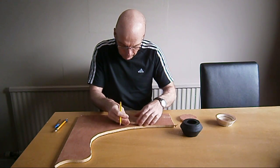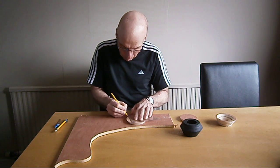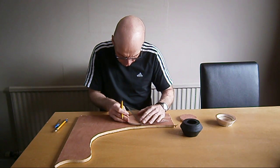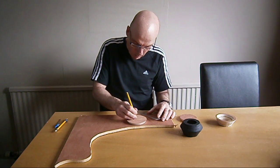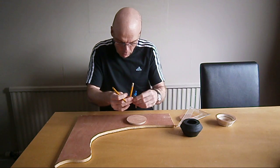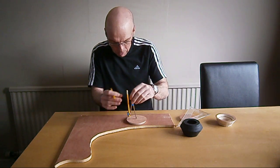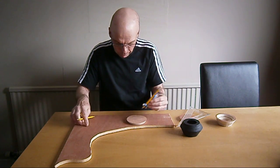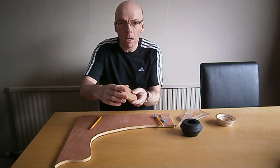Then, if you move it round slightly, same again — put that on the edge, mark there, mark there, and once again you draw a cross. Where the line crosses in the middle is the centre of your circle. So, then, you take your compass, bring it in to the width you want your hole to be, draw the circle again all the way round, drill a hole onto the scroll saw, and cut out to the same shape.